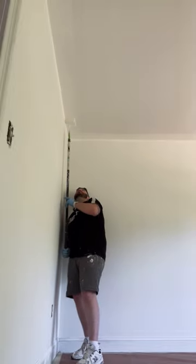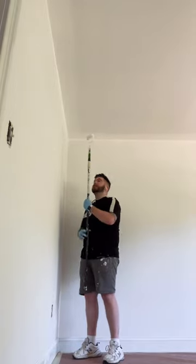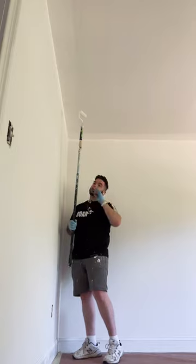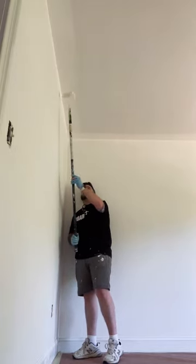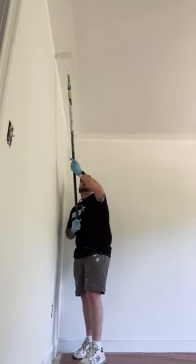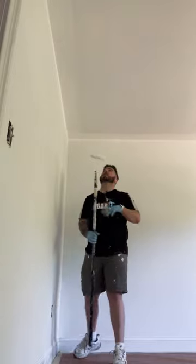You don't have to worry about hitting the wall because if you're painting the entire room, you're going to be painting over that anyways. As long as there's no big gunks drooping down the wall, you're going to be okay. Once I roll this out, I flip my roller so it's this direction, and then I just do a quick feathering — I just feather out the edge. And that's what I do.